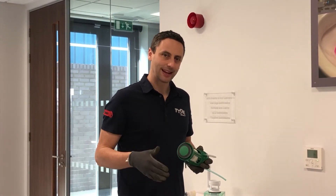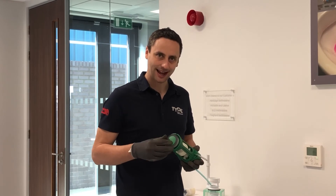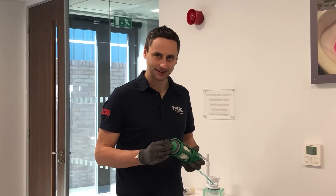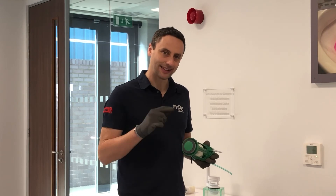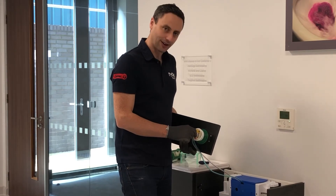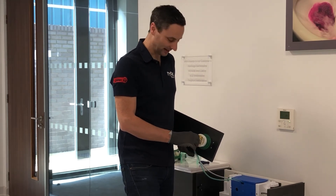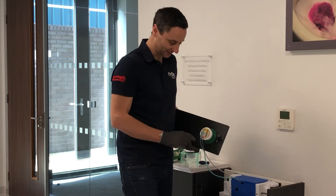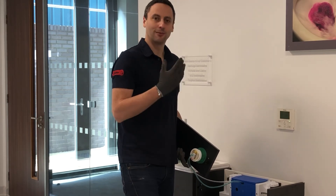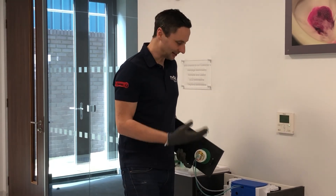If you're experiencing water being let into the pan, that can be caused by the dynamic seal leaking. Over time this silicone seal can have dirt stuck inside it or it can wear, and you can replace this seal if required. If replacing the seal still results in a leak, then that is likely your inlet valve that has failed, and we'll cover that in another video. When connecting the tubes back on, you must ensure the green tube is connected to the reduced flush spigot connector on both the flush button and the flush valve, and the same for the full flush. Sometimes people report getting a small flush when pressing the reduced flush button — in that case, try reversing the tube connections, either on the button or on the valve, depending on how it was fitted.